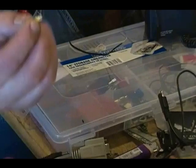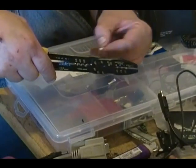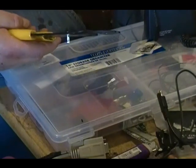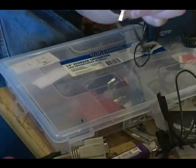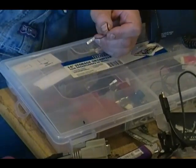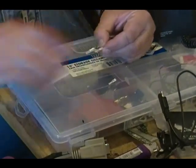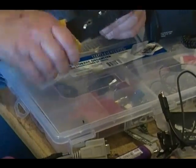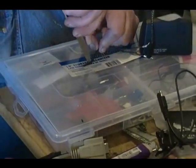There is the connector itself. These are the 15-amp sizes — the smaller one. Get it in your crimper, and point the puncture side away from the crease in the power pole. Get a little squeeze. You will notice no solder is necessary — you can solder them, but it is not necessary with the power poles. This is the Anderson Power Pole. The other one on the other side — a little crimp. If you put the puncture in toward the crease, it will give you problems; it will spread apart and will not connect anywhere near as well.